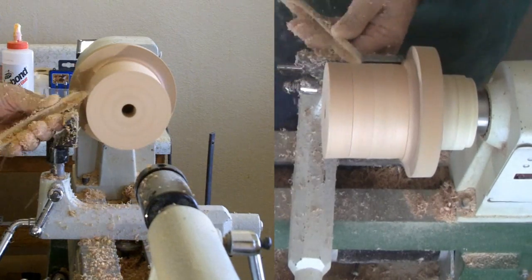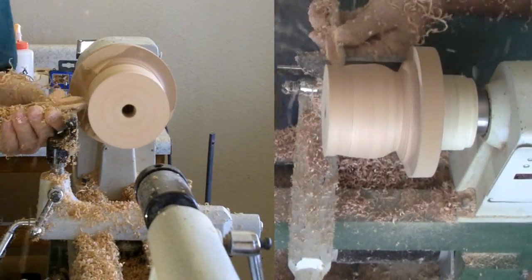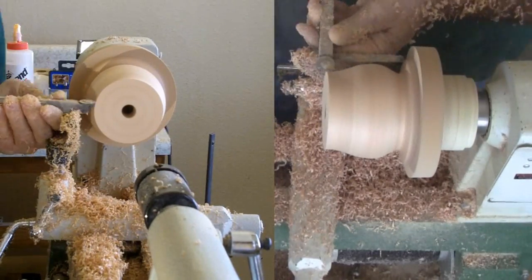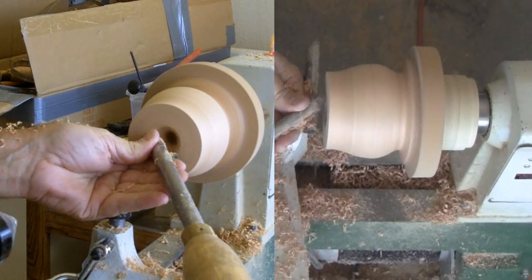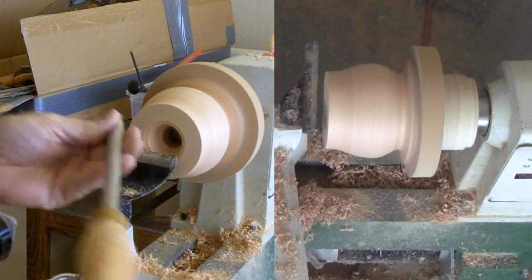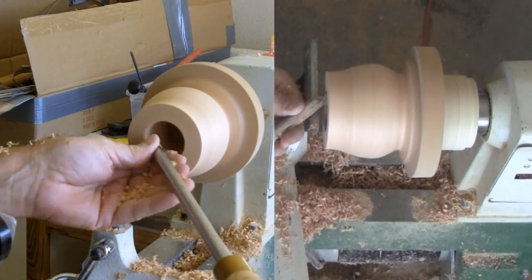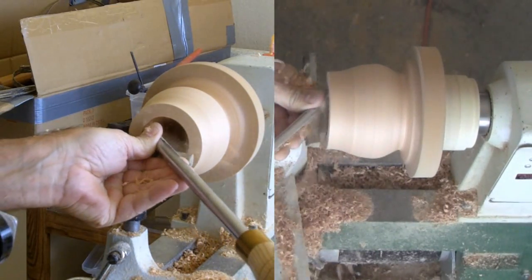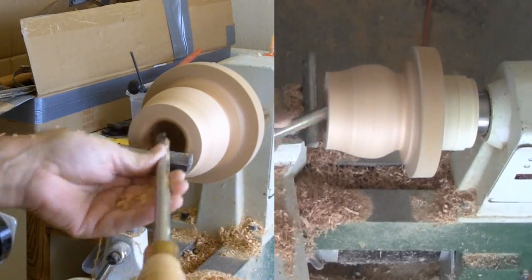Now for the top portion. With this simple shape, there's not much exterior shaping at this point. Then on to hollowing the inside — this is different than an end grain box since it is all face grain. It's kind of fun. I'll start out with a bowl gouge. Next will be to start forming the mortise or recess for the joint. I don't have a heavy square scraper so I'll use my square carbide cutter. The carbide is not ideal since it cannot do deep boring as well because the mounting bar gets in the way. But with a little care, it does the job.